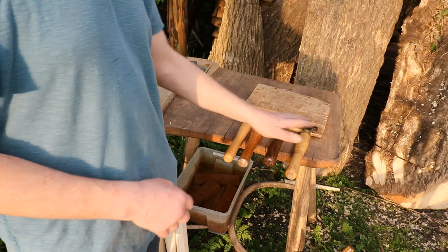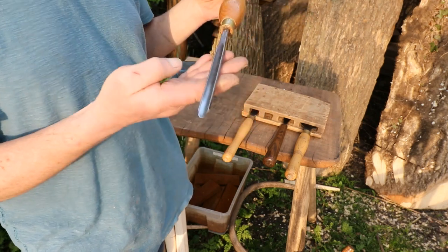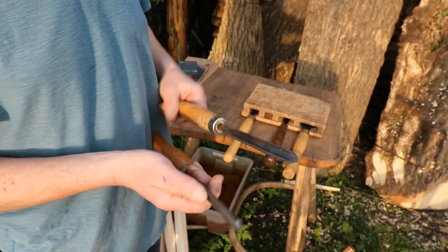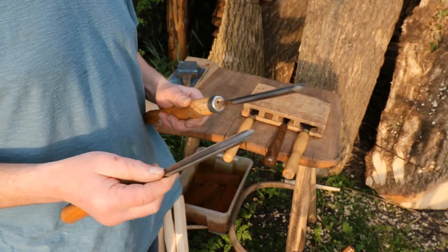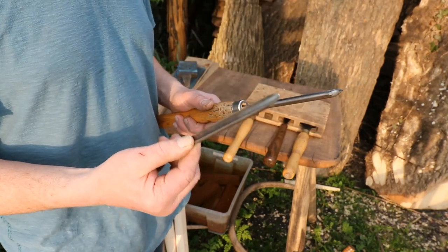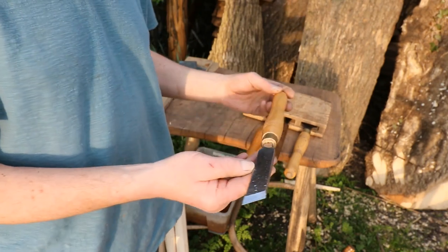So that's the flat chisel and the big gouge. If I'm wanting to detail smaller curves or rough out smaller bits, I've got a fingernail gouge - you can get them in different sizes. If you're doing a lot of delicate work go for a smaller one; if not, a bigger one just knocks it away that bit quicker. I tend to use that in conjunction with the skew chisel - roughing out with the spindle gouge and then finishing off with the skew chisel.